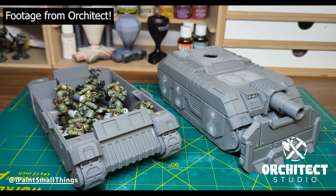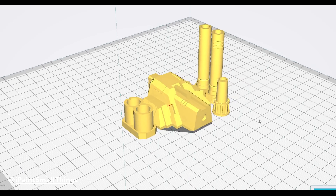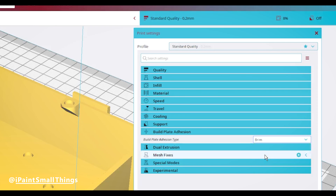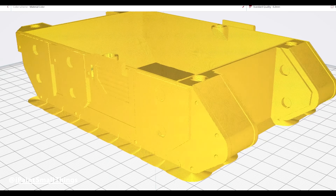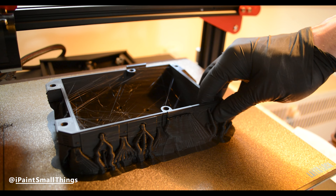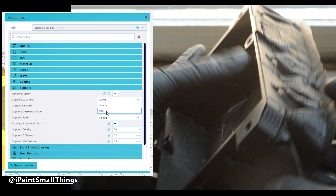Printing this thing out was pretty easy. While you can still print it on resin, everything is built with FDM printing in mind. I switched the build plate adhesion to brim, which creates a one-layer-thick border around your object — this helps keep everything nice and stuck flat to the print bed. You may not need to use this depending on your printer and filament. There are some objects that need supports; I used tree supports.